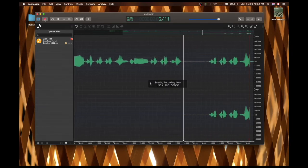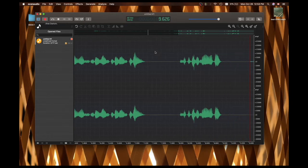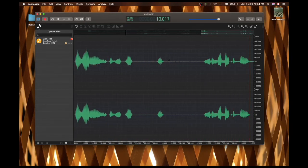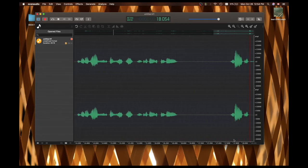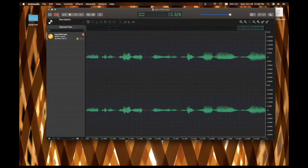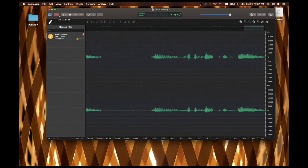Check, check, check. Hello, 1, 2. And we can see now that that audio is being split. That single microphone, channel 1, is being split into those two sides of the stereo channel. Now I can adjust the input level using the mixer controls, either the gain for the microphone or the main mix control if I want to boost that up a little bit.